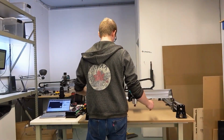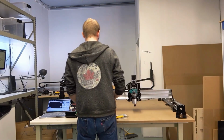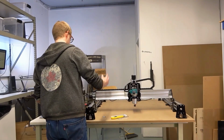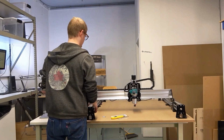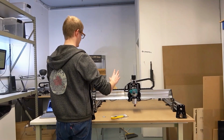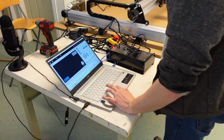And if you do double check your measurements or your diagonals and they are all adding up, then you'll want to go back to the screws and check that the screws are able to turn without too much resistance. Because when you hear that loud noise, that's basically the motors saying, I can't push any harder, something bad is happening.